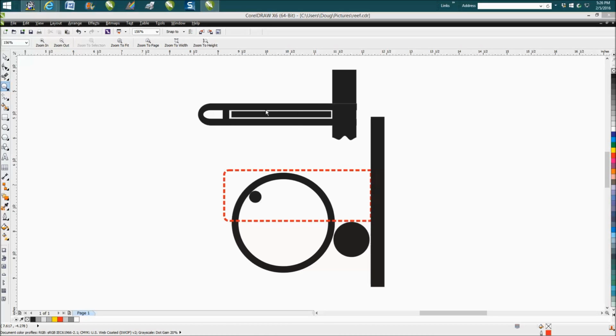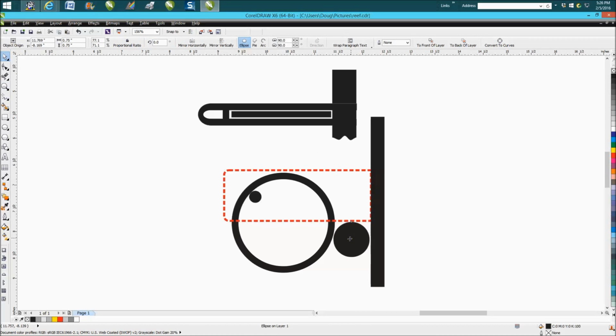So this is a top view. This is a side view. This is the pin that's going to move out and open the gate, or not allow the gate to open. So when you try to open the gate, this is moving and it can't move this pin up because it's strategically positioned. So then you take a 1/4 inch round stock, or any size, 1/2 inch, 1/4 inch I think works the best because it gives you the freest movement, I think. So this is that piece right here.